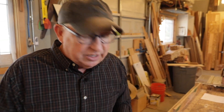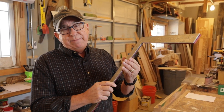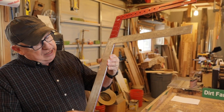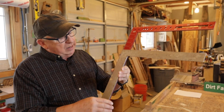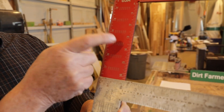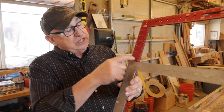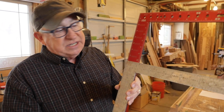There's a really simple solution: just use two framing squares lined up to create a giant caliper. By keeping the two tongues of the framing squares aligned so the blades run parallel, as you slide one back it shows the measurement on the back square. I like to use contrasting squares — this colored one is red with white markings — which makes it really easy to read the scale.